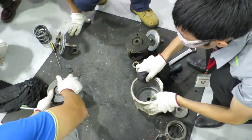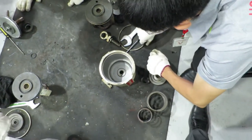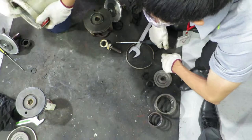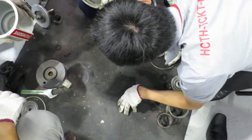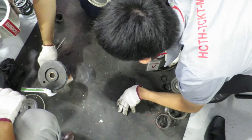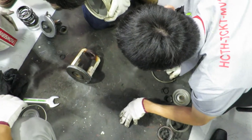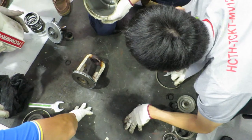Teaches how to inspect the problem. I will show you a problem one. This curve here, this curve is actually the O-ring seated area. We need to make sure they are smooth. No bend, no damage, and make it clean.